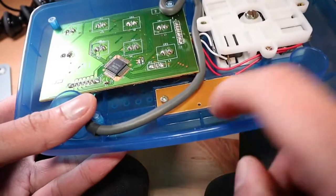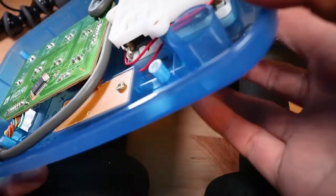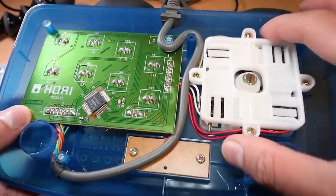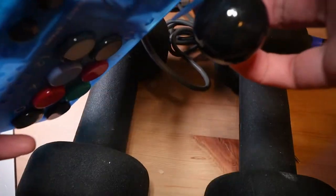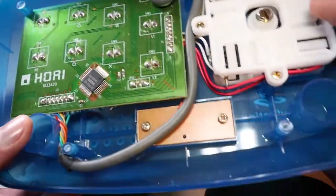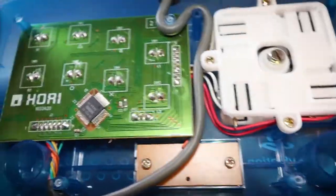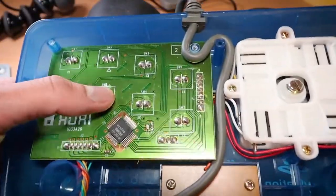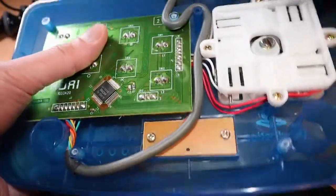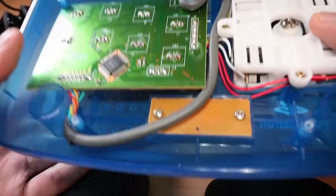There's a little breakout board for the Start and Select buttons and the PS1/2 cable. In terms of modding capability, similar to the Hori EX2 stick I can remove the joystick, but I'd have to snip the wires since they're soldered directly onto the switch terminals — which means you can't do anything without proper planning. I am interested in modding this stick. I do have a desoldering gun coming from AliExpress, which should make desoldering easier.